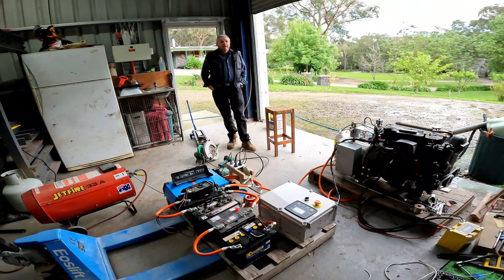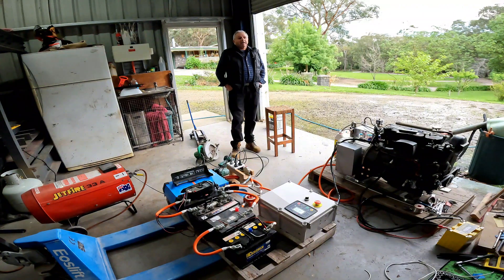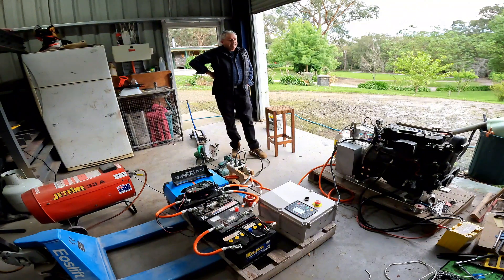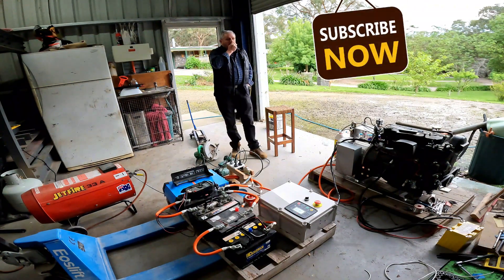The engine won't be drawing through the inverter — the engine will be either charging the batteries or driving the propulsion, which is two 16 kilowatt engines. It'll be drawing straight from the batteries. When I get to the point where I'm depleting my batteries I kick the generator in — the generator feeds the batteries and the batteries are still driving. At 3,200 RPM it can do 400 amps, and we got up to 2,250 RPM — so there's still plenty of room. Everything looks good. That tested really, really well actually.